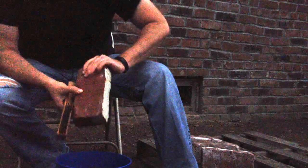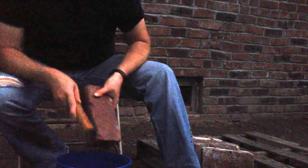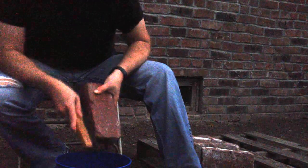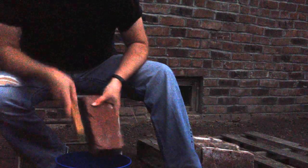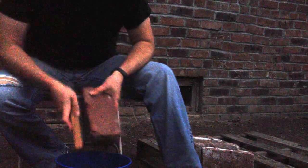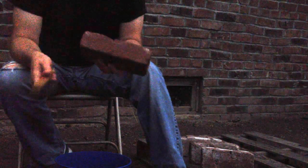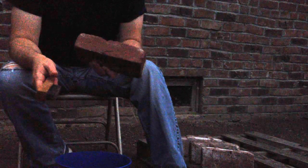And essentially that's really all it is. If you're working with old brick that you plan to reuse, which I highly recommend, it's really as basic as water, pressure, and a wire brush, and time. I can still work on the edges and stuff, but you can kind of see that just with relatively minor effort, just working at it with a wire brush, you can really clean up an old brick. Okay, that's all for today. Share, like, subscribe. I'll see you next time.